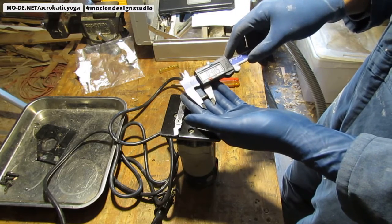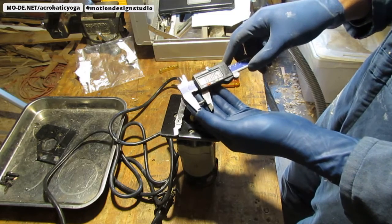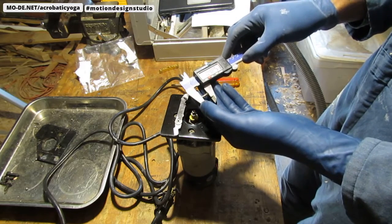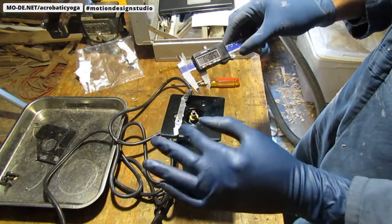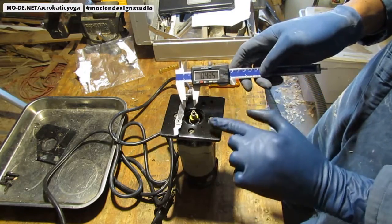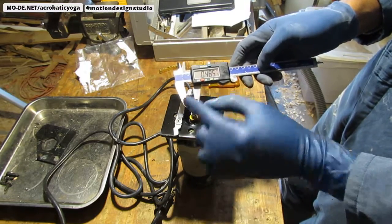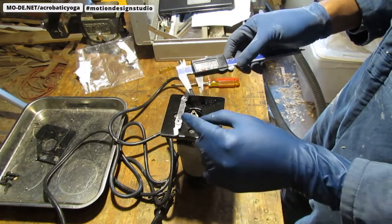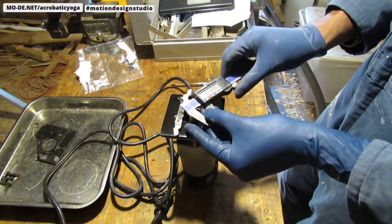this is 0.485 inches. So we're going to need to get to 0.75 inches in length. And that's going to give us enough space to screw the quarter-inch plywood onto there to make a base. So we're going to get quarter-inch length of that, all right? And so we're going to go do a little shopping.